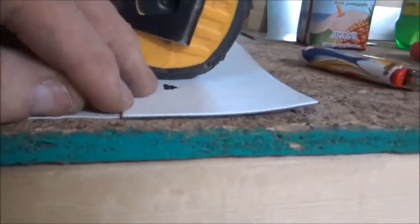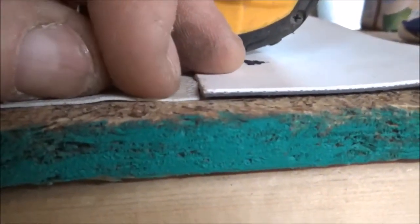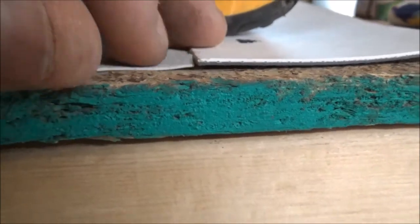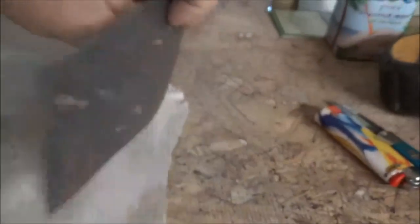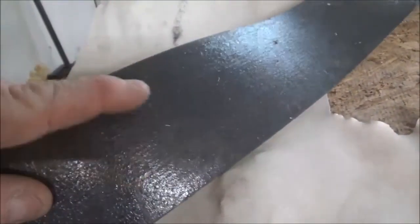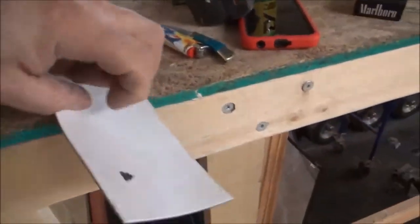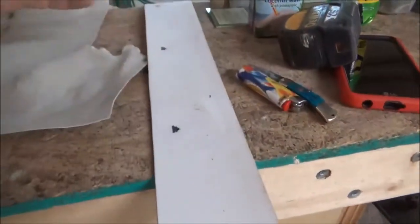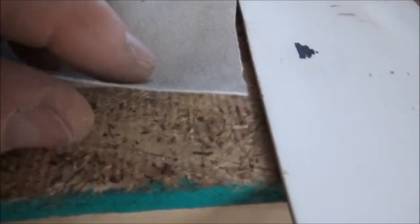Here's a better shot of this roofing right here from this Wildwood, so you can see just how thin that is — super, super thin. This is 60 mil, commercial grade. Same product you're going to find on a hotel, you're going to find on an office building. This is a structured membrane — you can see the little webs in there, that's what that is. It's got structure in it. This doesn't — this is just a mat, there's no strength to it whatsoever. So this is going to be a lot stronger, it'll have a lot more of what's called tensile strength. Tensile strength is resistance going down on an impact, so it'll have a lot more resistance to hail, branches, things like that. But that is just super thin.